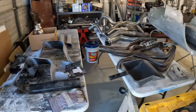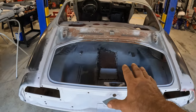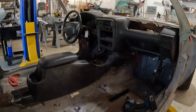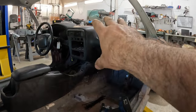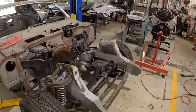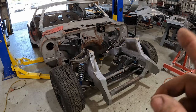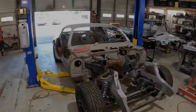The pile of parts is going to grow before it diminishes. Here's where we're at on the Firebird itself — it's basically a roller at this point, otherwise stripped down. I still have to pull the suspension off, the rear is done. I'm doing final fitting on the dash — it's in position, just a matter of getting some brackets and finishing up the top portion, plus getting the last of the HVAC components fitted behind it. Up front I'll have to pull the suspension apart, pull the subframe off, and do some final work on the firewall. The next time you see it, it'll be on the rotisserie and I'll be doing a ton of welding to finish up the shell.